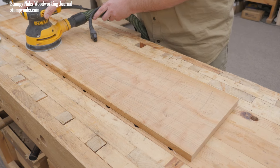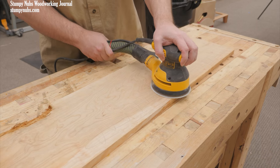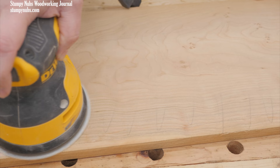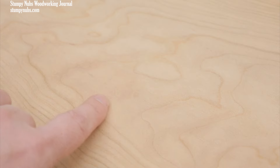Keep in mind, this tip is best for finish sanding. If you're using 40 or 60 grit on a rough surface, you're probably going to need to remove more material than just the pencil line. But at those levels, you can usually tell by eye when you're ready to advance grits. The pencil trick is for the next grit, such as 80 and above, when your progress is more difficult to judge by eye alone.